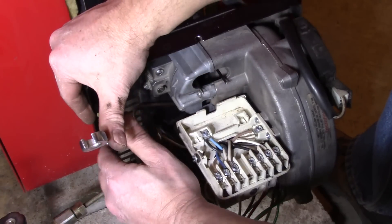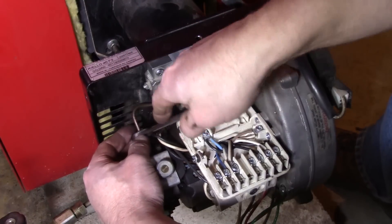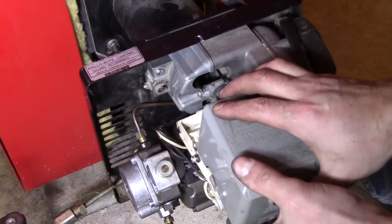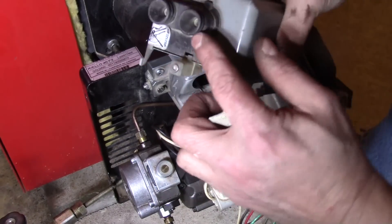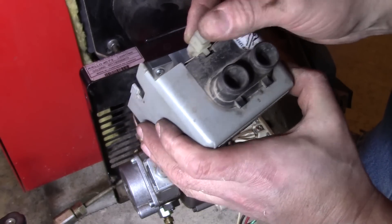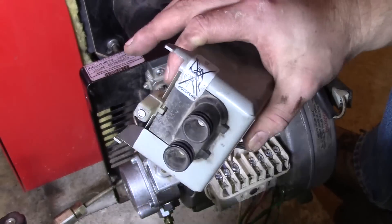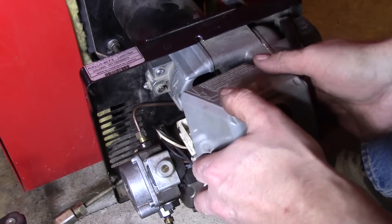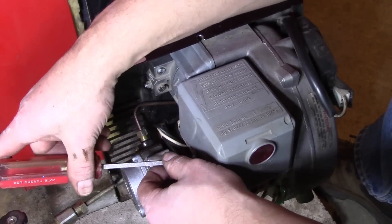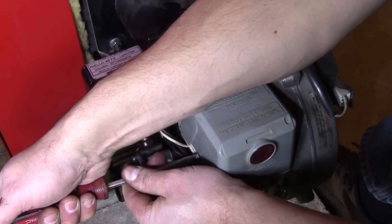Thanks for watching. Next we're going to be doing the boiler cleaning itself — not the funnest part of the job, but we're on the home stretch. Then we've got the control box: remember, it's got to be loose over here and you want it on the outside of this little slot. Tip it down — you've got these electrodes here that go into the burner. There's also an eye, basically a sensor — it's a good idea to clean that off as well. Usually I spray some cleaner and wipe that down. So let's get this tipped down and snapped into place. I like to tighten it down; sometimes after service I find this screw and the burner housing are not tightened down. I like to put everything back the way it's supposed to be.